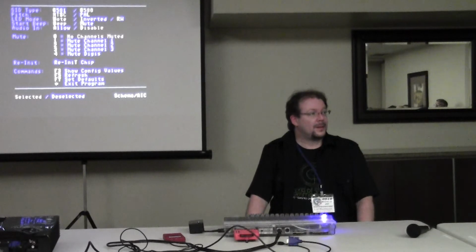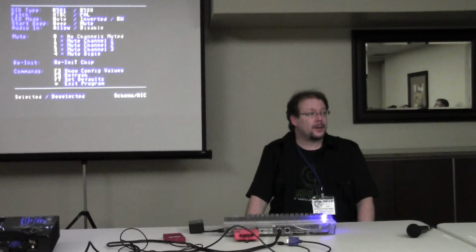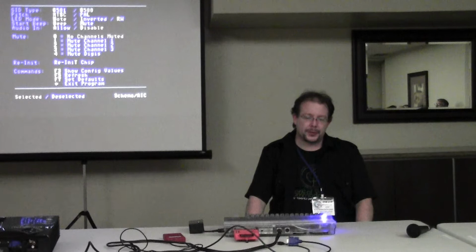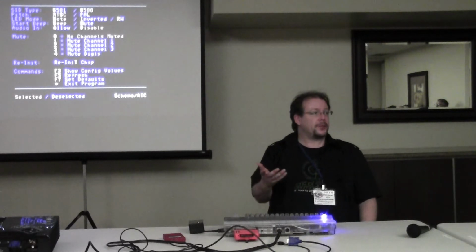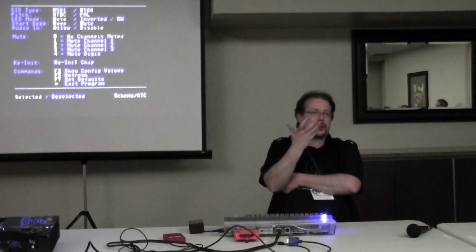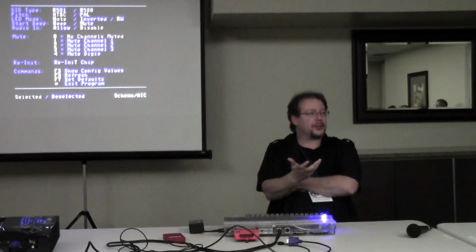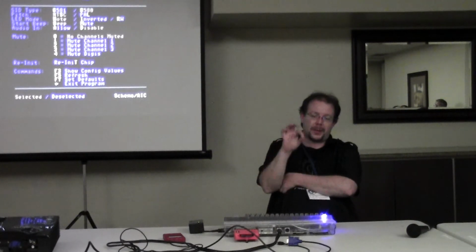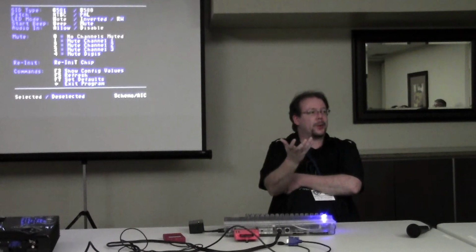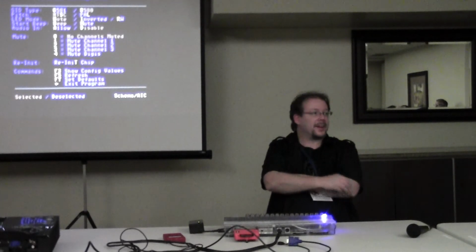I'm wondering now that it's like this, if you could add extra features to it. Well, there's some address space that SID didn't use, isn't there? Well, there are a couple of really obscure features, like you can create your own waveforms. You know how the SID has your sine and your triangle and your sawtooth. You can upload your own waveforms and say you now have a custom sound that never existed on the original SID. But that part isn't persistent, so the idea is for a demo to upload a waveform in real time and then play it, and then it's gone when you turn the power off. I haven't investigated that because I only have so much time.